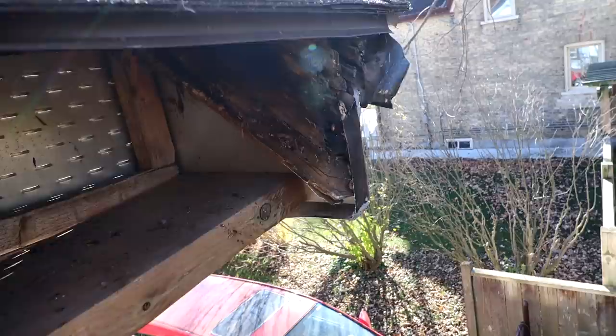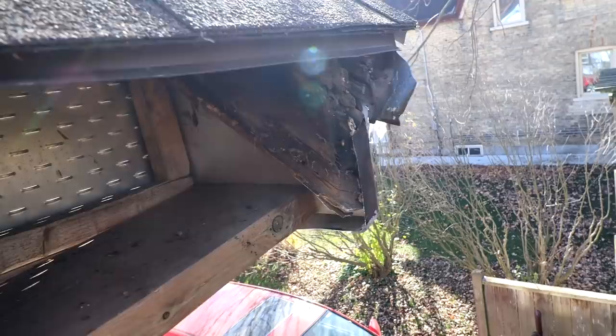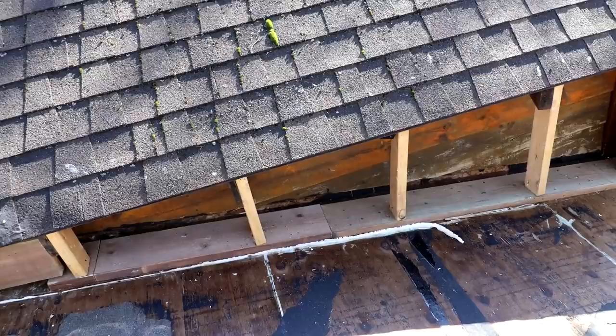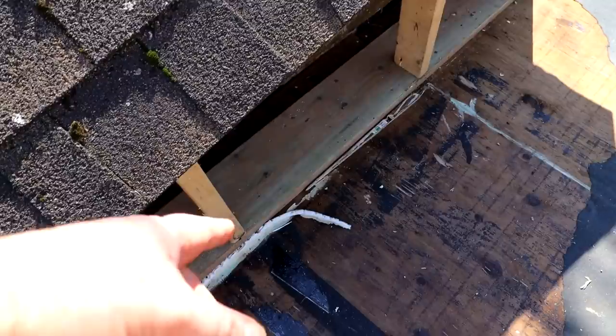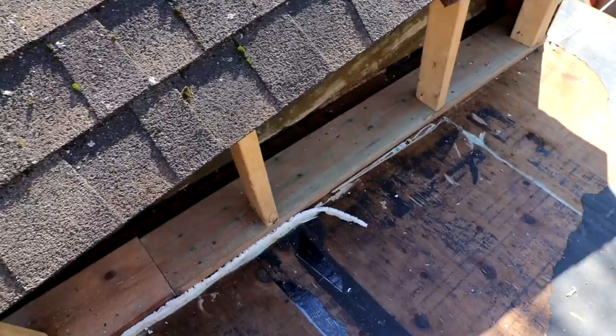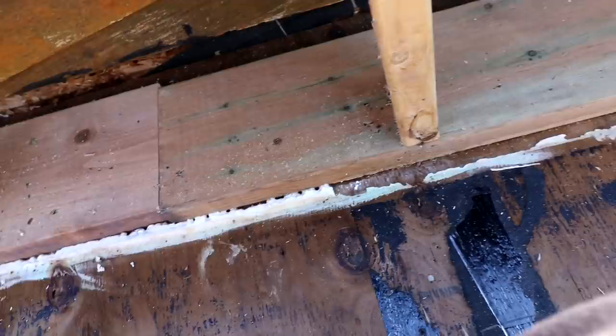Up here they had some blocks screwed in but not into anything solid. And here's the problem - you've got a rotted end there, not fixed, just left rotted. They just flashed around it, never solving the original problems, just covering it up. I'm glad I took this all apart because I know for a fact this would have leaked every year and helped rot out my roof. All the plywood here was already soaking wet when I moved the flashing and it hasn't rained for four or five days. That would have rotted out in probably four or five years. Their solution was to just put crap in here and caulk - drives me nuts. They used so much caulking instead of doing things right. We'll get it fixed.